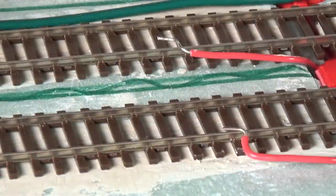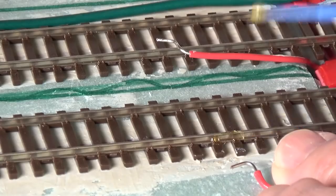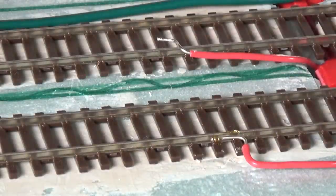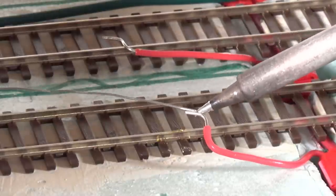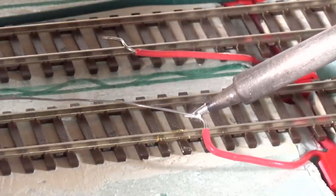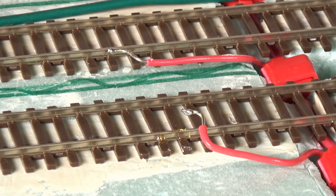So what I want to do now is go ahead and solder a couple of these in place. I'm not going to do all of them, but I'm just going to show you how I'm going to go about doing one or two. So I'm going to take a little bit of my paste flux, drop it into place — I've got my soldering iron heated up. I'm still using my pencil tip, still testing that method out. The first thing I'm going to do is apply some solder to this piece of solid wire — these are 18 gauge solid wires. So I'm pre-tinning them. And then I'm going to pre-tin the track where I'm going to attach it.